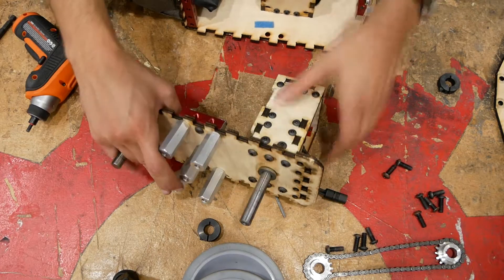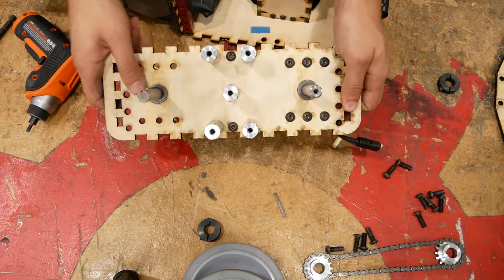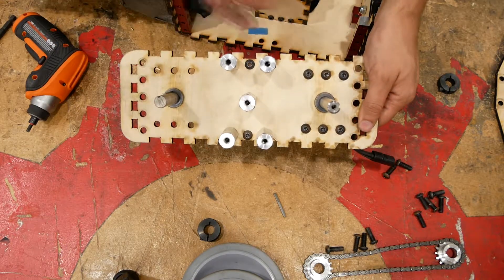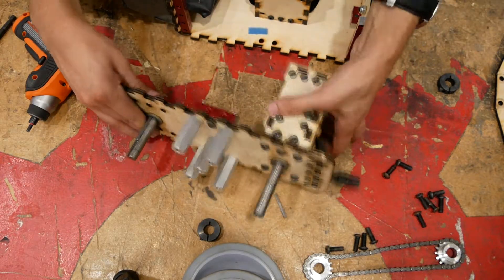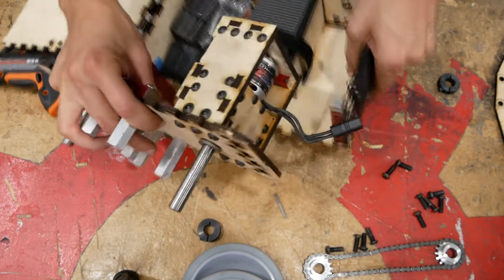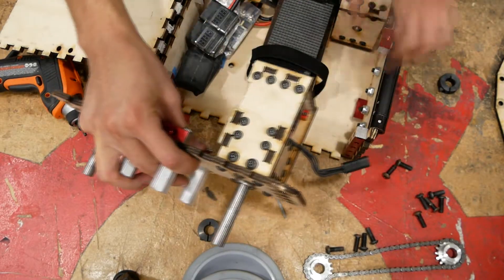One potential fault of this design: the nice part is that if you make all the parts symmetrical, you don't have to worry about cutting slight variations and accidentally cutting the wrong one and ending up with a part you can't use. The bad side is that anything that actually needs to be aligned can be put in backwards. As I've been reassembling this, I put this drivetrain box in backwards — the cord is sticking the wrong way into the outside wall, so I need to flip it 180 degrees so that the motor lead is sticking back towards the electronics.